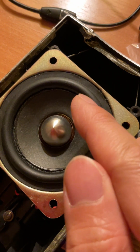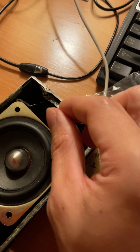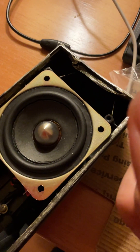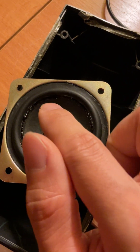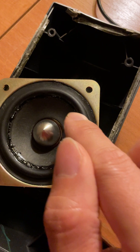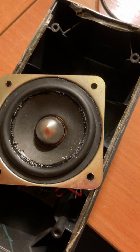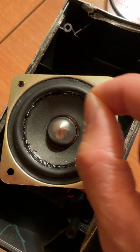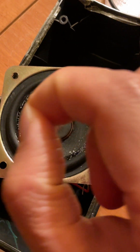I decided to glue the outside first — you can see just a little bit of glue residue on the outside. I would describe this glue as almost like rubber cement, to the point where this little residue on the outside — you can almost take it off and roll it around your fingers and it doesn't stick. Right after gluing the paper cone to the rubber gasket, I just went around with the tip of the glue bottle right in between the two surfaces, putting down a layer of that rubber cement. Every little bit of weight will change the sound for this speaker, so I want to remove as much extra glue as possible.